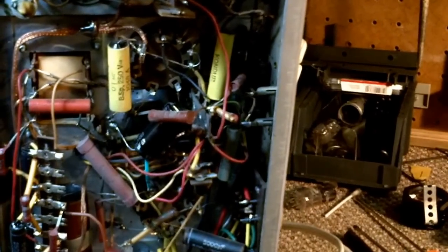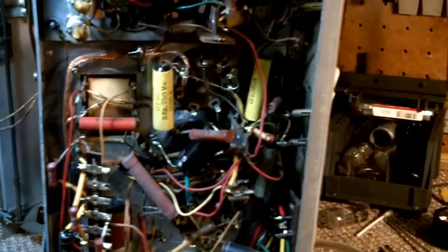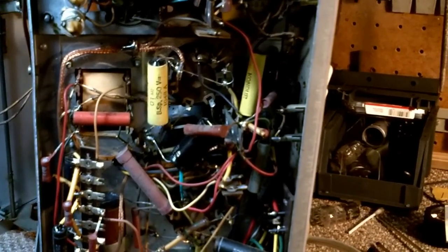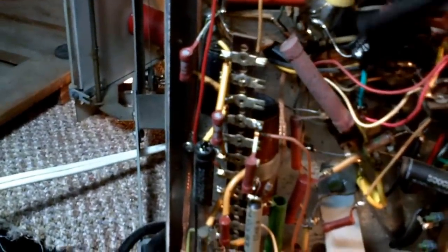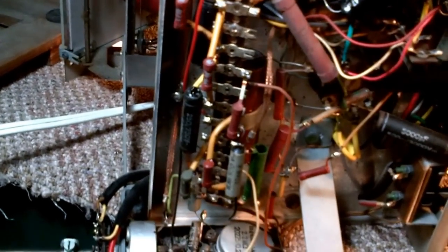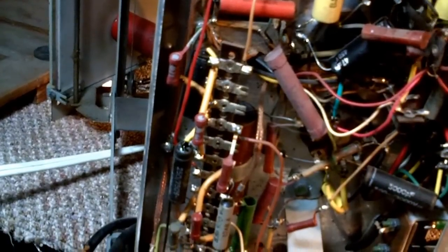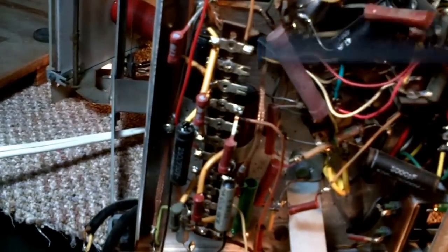I think I'm going to have to do some kind of isolation of the noises that we hear. Stage isolation, maybe by shorting out stages, seeing when the sound comes and goes, to try to isolate the component that's responsible. My whacking of the parts didn't do me any good at all. Never been very successful with the whacking of parts.